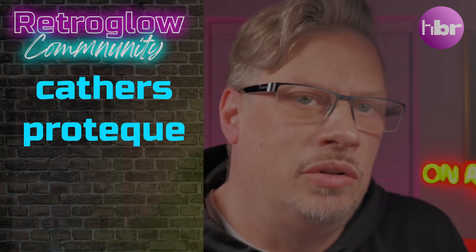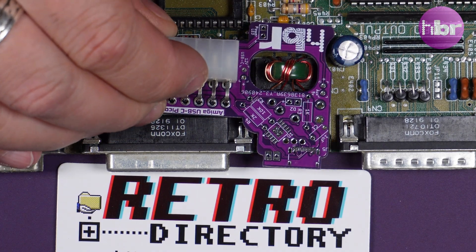There is definitely some room for improvement. The switch isn't ideal — it's absolutely minute and quite fiddly to get to. One of the reasons this doesn't quite fit in this Rev 5 is because most of my original designs were around the Rev 8, the Amiga 500 Plus. It's a relatively good fit, but some tweaks will make it better. It also makes sense to relocate the ATX power supply using a simple extension cable to somewhere more sensible in the case — at the moment it's sitting right on top of one of the CIAs, which from a heat perspective isn't ideal.